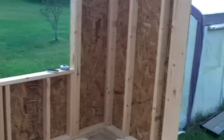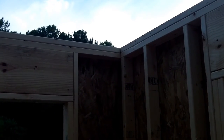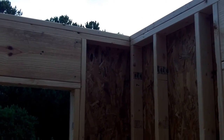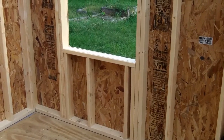The next step — one thing I want to mention: these walls have braces on the outside, but those are just for my peace of mind. The studs in the corners are screwed together and the double top plates are keeping the tops from falling one way or the other, and that goes all the way around. Apparently that is a very useful thing to keep your structure from falling apart and keeps your corners locked. I found out it's much easier if you put those double top plates on after you raise your wall instead of before — keep that in mind if you're going to do something like this.